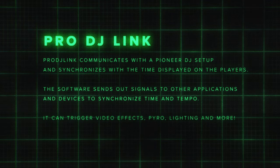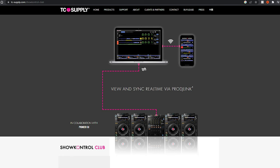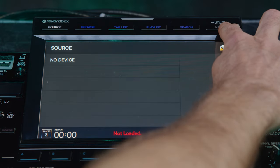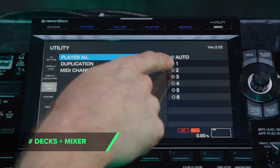Let's start with setting things up, beginning with our DJ decks. It's important to set up the CDJs so that they send the correct info to the show control system. Pro DJ Link is the network-based language that Pioneer DJ decks use to talk to each other. Show control listens to Pro DJ Link and outputs timecode to external systems. To set up the CDJs, connect all of the CDJ decks and DJM mixer to an unmanaged network switch. Make sure that any USB sticks and sources from the decks aren't connected, as having a USB stick selected will disable changing core settings. Long press the menu button, which brings you to the utility page. Under Pro DJ Link, change the deck number to correspond to the numbers you want to use with show control. The standard varies depending on the artist, so check with the music artist to make sure you're speaking the same language with deck numbers.